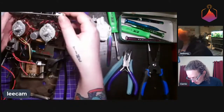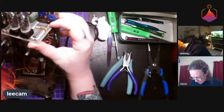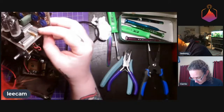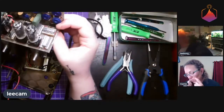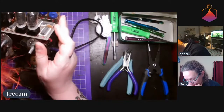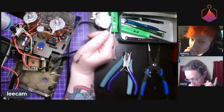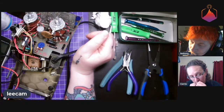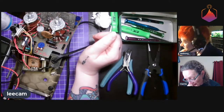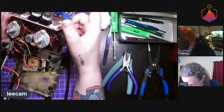So now it also talks about transistor Q11 and its associated resistors, capacitors, and diodes. Yeah, those are the only two things connecting these. Ooh, so this is another interesting one that could perhaps describe the problem. A particular digit lights. However, all numerals appear dimly lit. For example, a 3 condition always faintly lights 0 through 9. And the causes of that are an open tube socket pin or an open decoder driver pin. Okay. What do they mean by open?